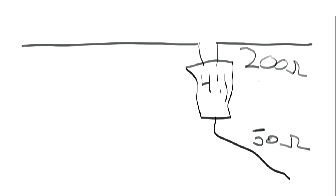If the impedance right here happened to be 300 ohms, you'd want a 6-to-1 balun. And I see a lot of off-center fed dipoles, and that's basically what we've drawn here. Yeah, that's what mine actually called for. Yeah.